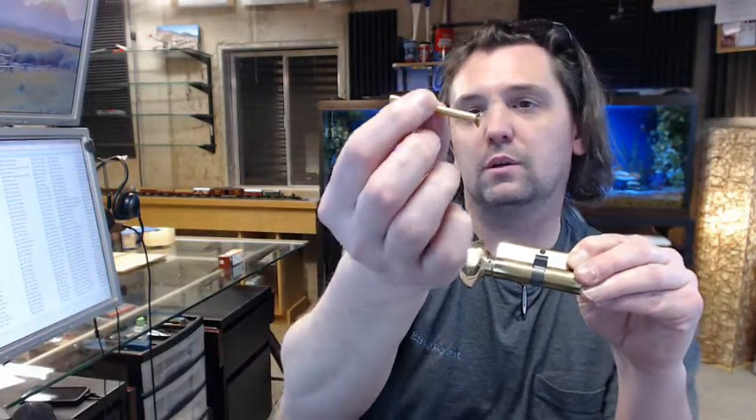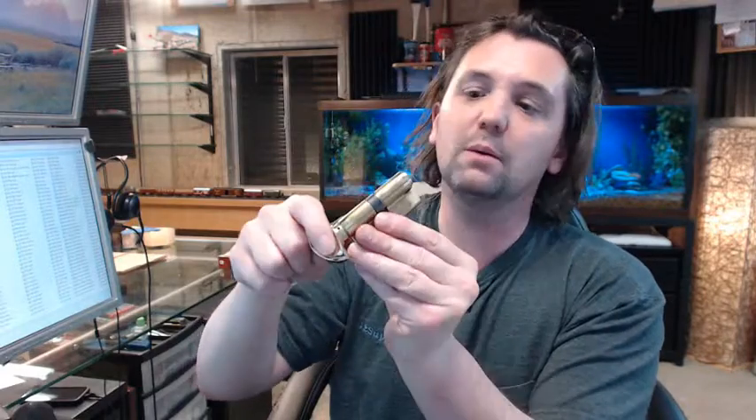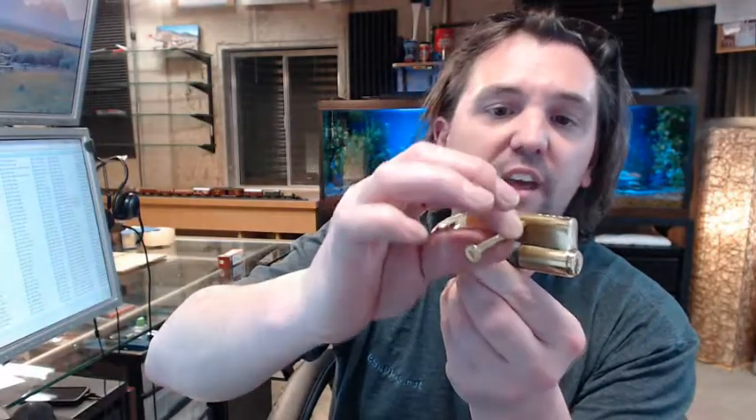It's going to include a long flat head machine bolt — I'm going to guess it's 10-32, but it's only a guess. You'll see a countersink in the edge of the door. Once you get that slid in — I've seen them installed both ways — you'll run that bolt from the outside right into that tapped section in the top of the cylinder.